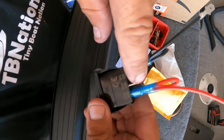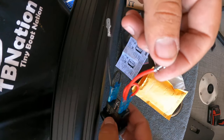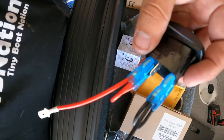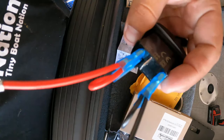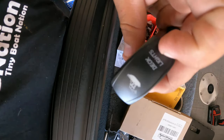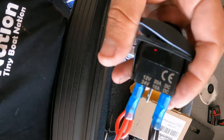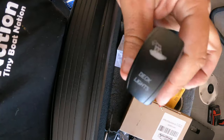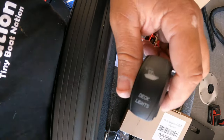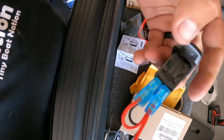If you play musical wires and guess, you can likely catch something on fire or melt your wire or switch. That red loop-de-loop wire is all piggybacked — daisy chained — and it's going to be coming from the battery. That middle pin, which would normally go to the accessory, is going to go to the relay. The extra wires on the five-pin switch are just there to light up the indicator LEDs inside the switch itself — it's a switch with extra lights.